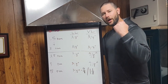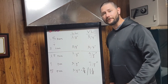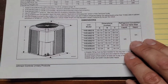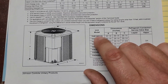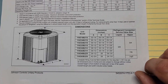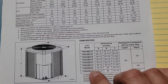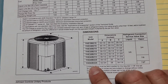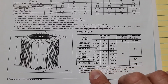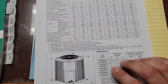I'm going to show you how to get this information. Always consult the manufacturer's installation instructions — there's guidance in there to make it easy. This is our customer booklet that came with the equipment. Do not throw this away. At the bottom of the tabular data sheet you'll find every model from their lowest BTU — 1.5-ton — to their highest, 5-ton, with refrigerant connection service valve sizes. With our 3-ton unit we have 3/8" and 3/4", with our 4-ton unit 3/8" and 7/8". For the 5-ton, it says 3/8" and 7/8" with a symbol noting that an adapter fitting must be installed for the required inch-and-an-eighth line set size.